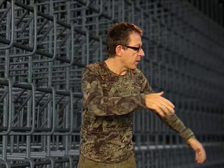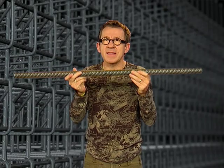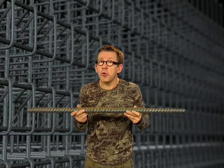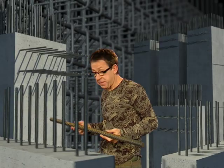To resolve this problem, bonding bars were produced with profile patterns — in other words, with a raised pattern. The new bars perpetuated the tradition of lapping. The technique is proven and is still used today on many work sites. All these bars sticking out of walls are waiting for lapping.